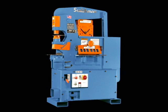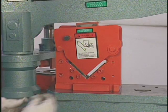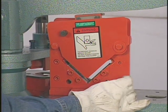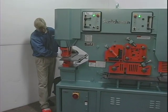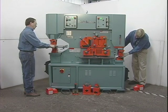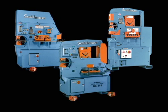With a component tooling style machine, the only permanent features built in are the punch and flat bar shear, and on some models, the rectangle notcher. Please note that all Scotchman ironworkers are supplied with an angle shear as standard equipment. The balance of the tools can be purchased at any time. The dual operator machines combine the features of both models in a machine that can be used by two operators at the same time. All three concepts are very popular — it's just a matter of personal preference.